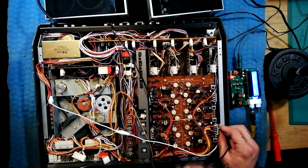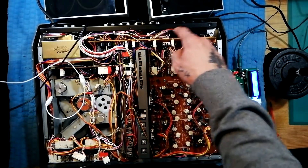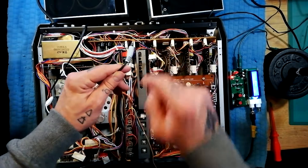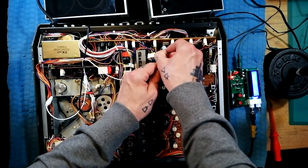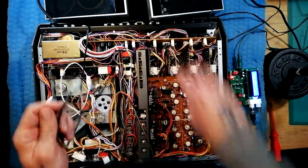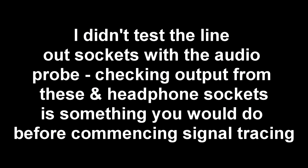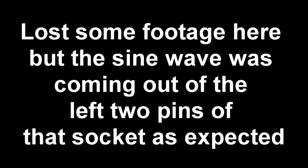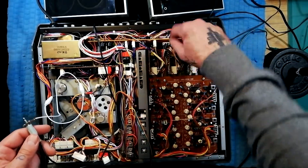You can see the brown one is at the top of these four pins — if I touch that, there's our sine wave again, so it's getting as far as there. I haven't bothered to remove the DBX board. I wonder if we can reach the channel one fader — oh yeah, there we go, I can hear it, so it's getting to the fader. It then goes back into this board and passes through the master fader, which is attached at this plug here. The middle pins are ground, so it's these two outer ones. I should have a sine wave on both because the pan control on channel one is set at 12 o'clock. Yeah, it's present. So it's getting to the master fader, and then it splits for the line out and headphone amp. These two pins are for the main bus — that tells me the signal is getting out of this board successfully.